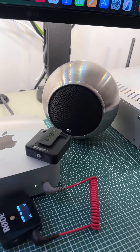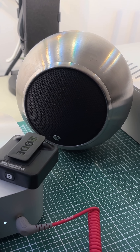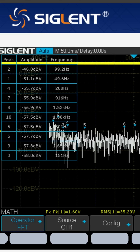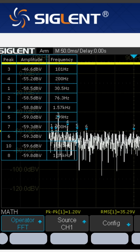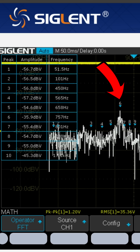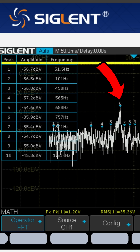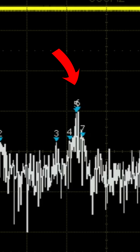What? Now I have noise coming from the speakers! How is that even possible? My oscilloscope and electronic load revealed that the power supply's output is quiet with a normal load, but with a very small load — which unfortunately matches what the Maya does when it's idle — the Syncon is injecting a 780 Hz noise which is audible through the speakers.